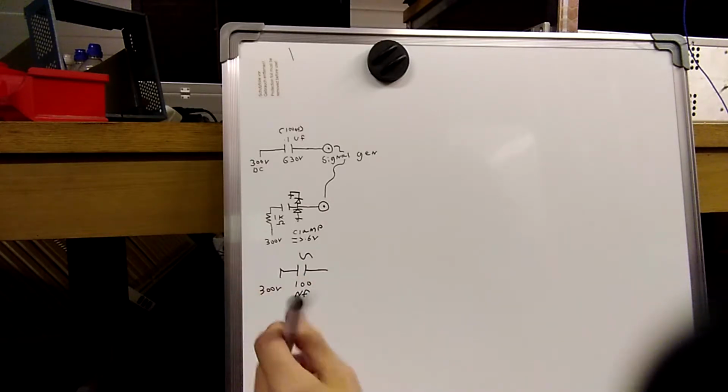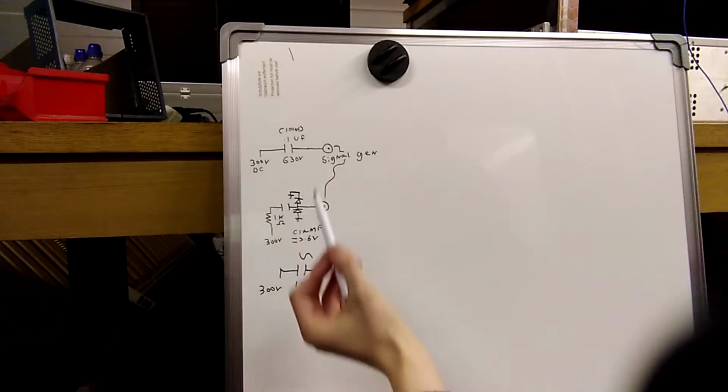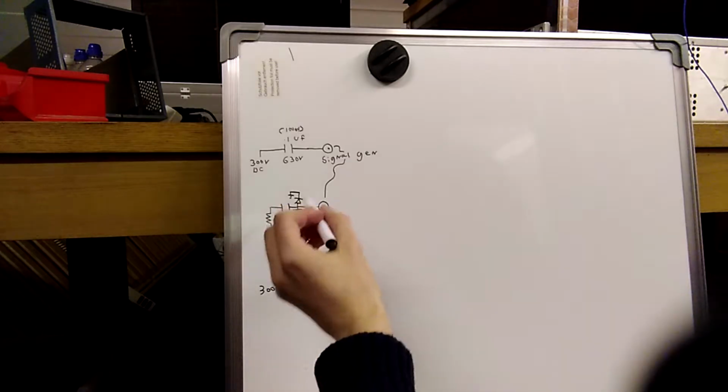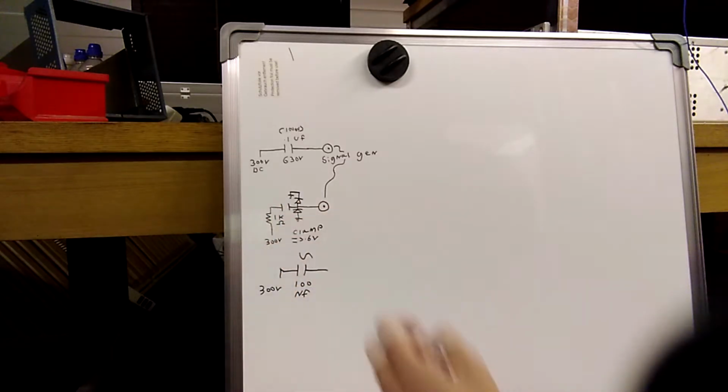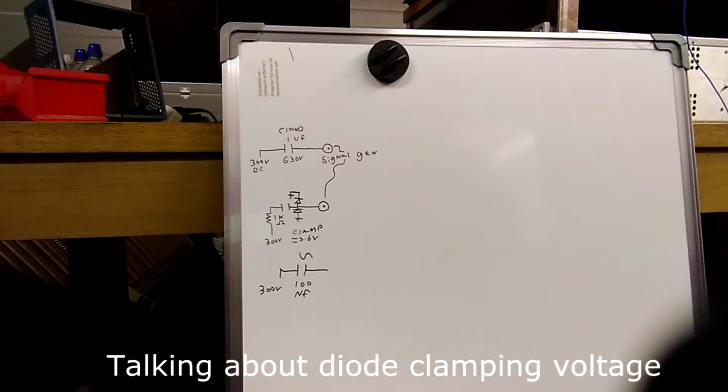The most common one is you just do a diode clamp. See up here, where you have two silicon diodes, or whatever diodes you're using, going to ground, right? In this configuration, this way it gets both the positive and negative part of the waveform. So you can just pretend it is around 0.6 volts. Of course, this depends on the current and the heat that I run, but it doesn't matter. It'll protect it either way.